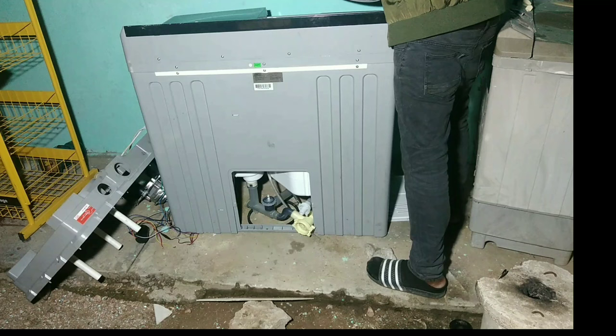Okay guys, it's time to check on this water pump and see what the problem might be. As you can see when I'm trying to push this back and forth, there's too much play — and that's a new impeller compared to the old one. I guess that's the main reason why this was causing sound, because when it tries to spin the impeller was hitting against the housing wall. So I'm cleaning one of the old impellers and I'll use it to replace this new one.